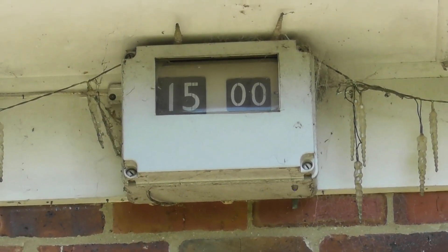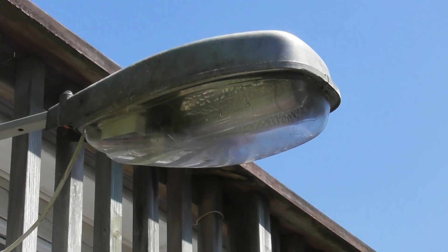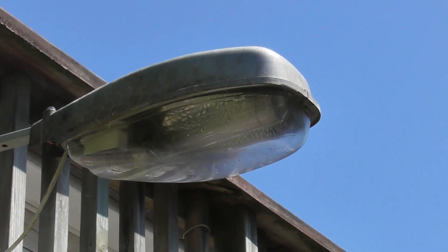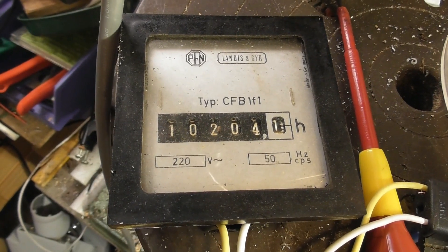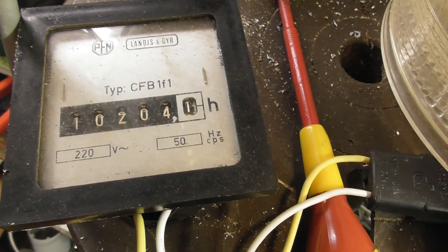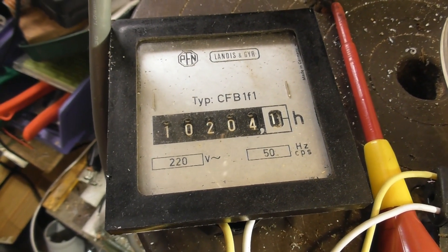There we go — 1500 hours, 3 o'clock in the afternoon, beautiful blue sky. This is a successful conversion and I've got the original 70-watt ballast with a fluorescent resin ballast in series. I'm going to do some usage tests on low-pressure sodium lights — I only have 35-watt bulbs. I'm just testing this hour meter, connected up to 240 volts. It's actually a 220 meter but I'll give it a run to see how accurate it is, and that will be implemented in the following experiments.